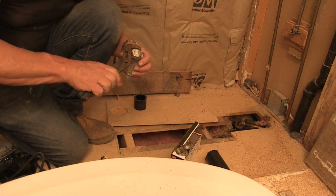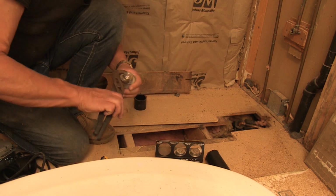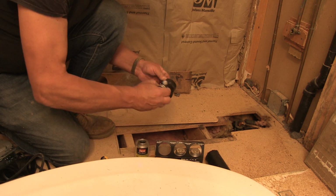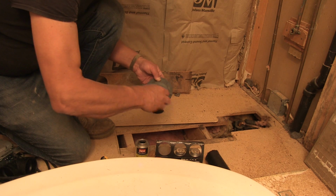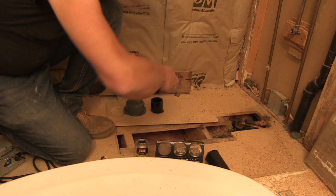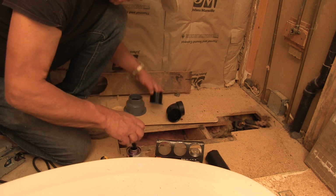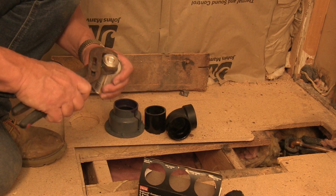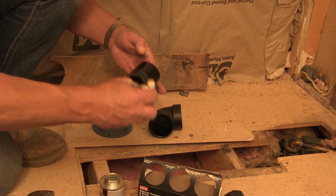Okay, I've got this pipe cleaner, primer, and glue to glue my pipes together. So we're going to try to fix this. Here's the cleaner. Make sure we get a good seal. Clean the inside of this, and clean the inside of my elbow. Not this elbow, this elbow. Now we purple prime this. I'll let that dry. Now I glue it together. Let's see. Glue this. Glue this.